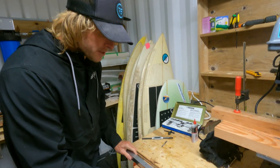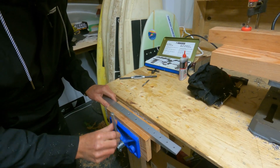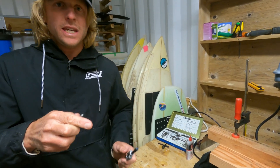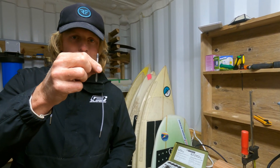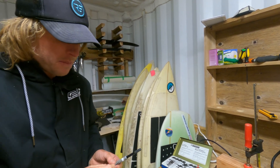I like to just put it in a vise, get it nice and stable and flat. One of the things about tapping a hole is you have to keep it plumb — you have to keep your tap nice and square to the metal, otherwise you end up with bolts that are going to be on angles. So that's something to keep in mind.